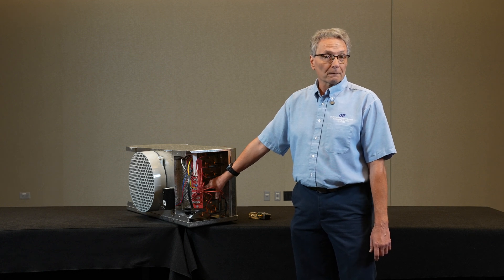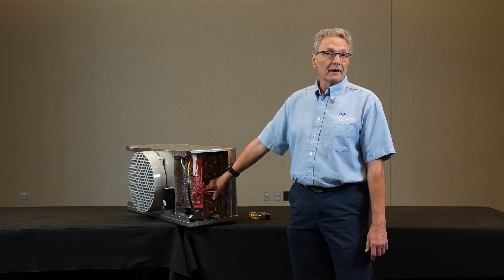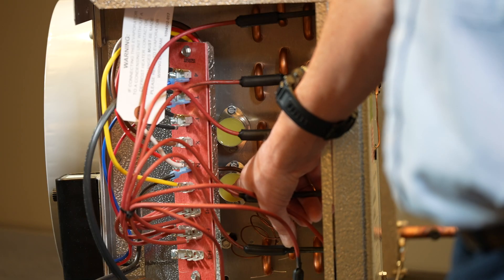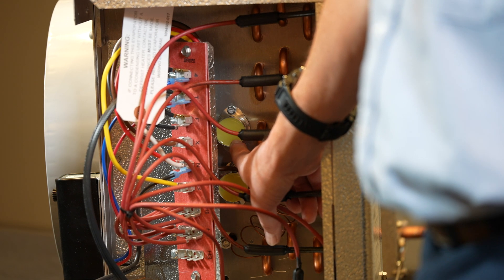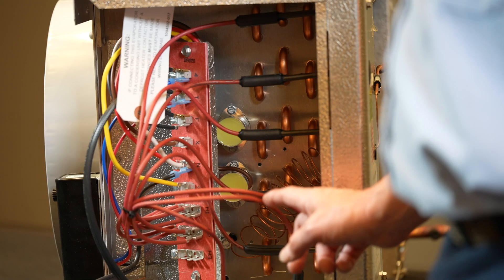Always remember that the three-way switch is the primary and the time clock is always the backup. In case something happens in that circuit, that is why the heater safety is there — it's in series to take out the heaters if the evaporator goes over temperature.